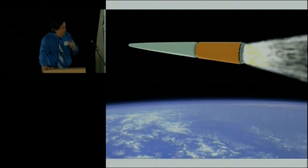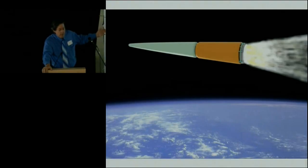This is a classic plug nozzle - it looks unlike conventional rocket nozzles; it's a perimeter nozzle basically. When you're under high G's, you don't want things sticking out far because they'll crumple. So this is a plug nozzle which is quite short but circumferential around the body of the vehicle. There's also an attitude control system not shown here. The vehicle is burning and approaching 500 kilometer altitude.